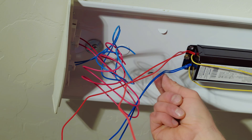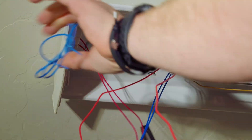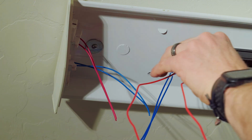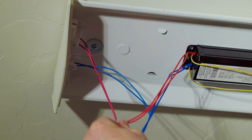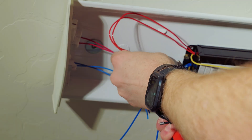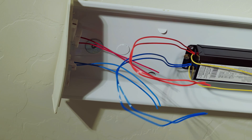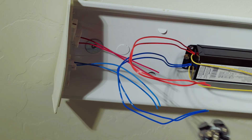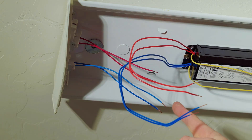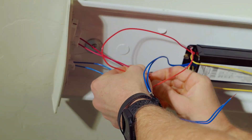Now that the yellow side is wired in, we can go ahead and finish up on our red and blue wires. These are pretty close together, so we don't need a lot of wire length — just enough so it's not pulling in either direction. We'll cut these about halfway and do the same thing with the red side. Now we can match our wires from the new ballast over to the old existing wires, leaving a little extra length so they're not pulling. We'll do the same thing with our blue wires. Then we'll take our Klein auto strippers and strip all eight ends — about a half inch of insulation. Once all eight ends are stripped, it's time to connect the reds with the reds and the blues with the blues with wire nuts.